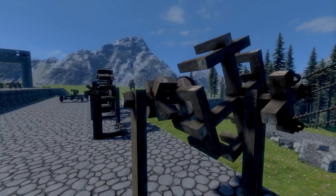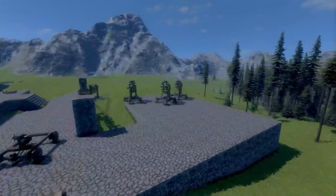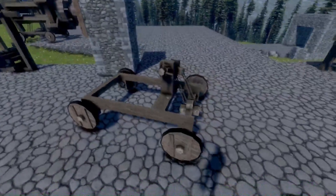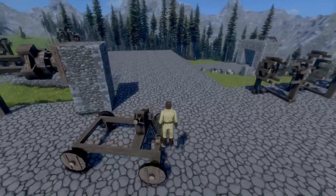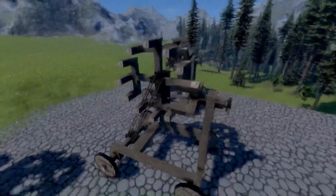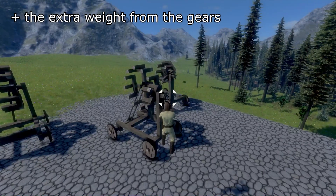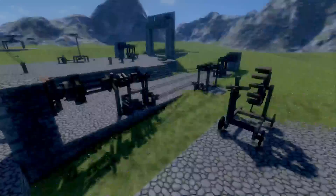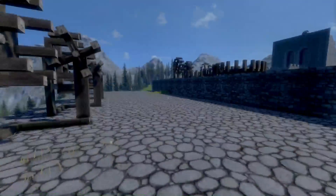You can see the small gear is spinning faster than the large gear. Over here I have some examples of what you could use this for. If we take this little car and try to move it with no gear reduction, we're not able to. But if we use a four-toothed to twelve-toothed gear — the most efficient setup I've been able to make — we can actually move the car. That said, you can't stand on it while driving because your mass stops the thing from moving.